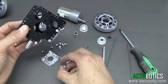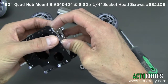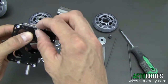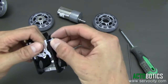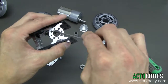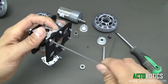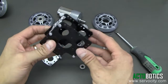Now we're ready to put in the top crossover plate on this side. We'll go ahead and put it in the highest setting. This plate helps keep the two black Delrin plates parallel, and also adds a nice additional mounting position. It gives you a 770 mounting position at an angle, which in several robot and dolly applications comes in really handy — especially if you're trying to mount a GoPro camera off the side.